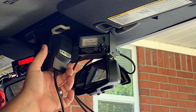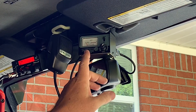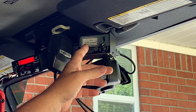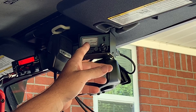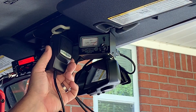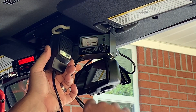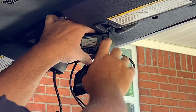On channel 1, we're going to transmit and then flip the little toggle switch down to REF. What we're looking for — from the information I've gathered — is an SWR reading below 1.5. There's a red danger zone around 2.5 to 3 on the meter; if you're there, you've got problems — improper grounding, cable issues, or the antenna needs tuning. Transmitting now and pushing the switch to REF, we're about 1.6 to 1.7.